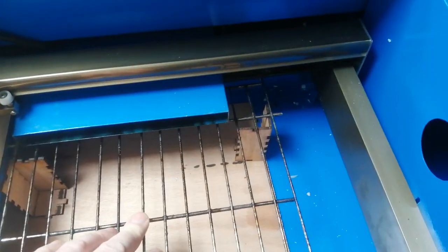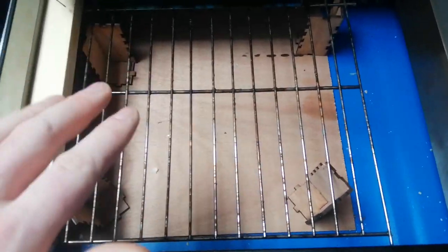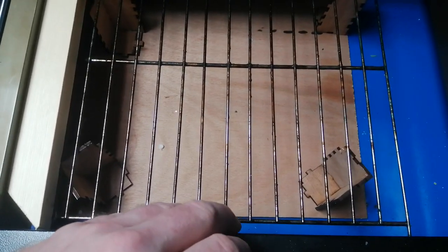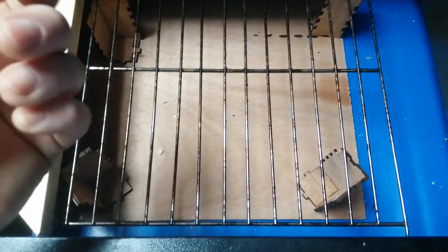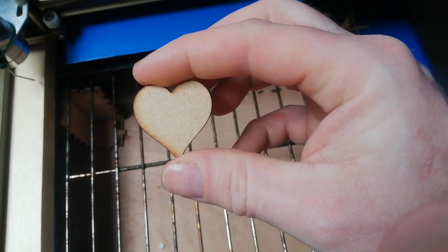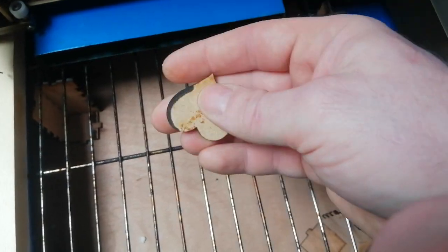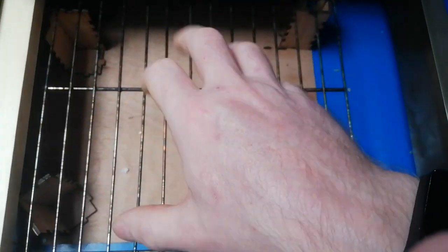The bed is a little bit wobbly, but it doesn't have to be very stable because there's no pressure going down — it's just the laser penetrating. This is an old barbecue rack that I had, cleaned it up and put it in here. The reason I've used this is because the thicker the bars are, the more surface area, and the more burn you're going to get on the back of your pieces as the laser burns through. So with the stock bed, you just end up with loads of burn on the back. This was the top side — there's very little burn there. And this is the back side. This huge area here was the laser reflecting off the aluminium bed that comes with it. That's quite a bad design.